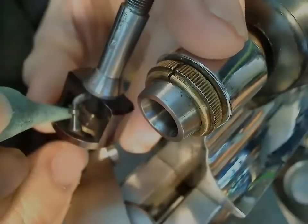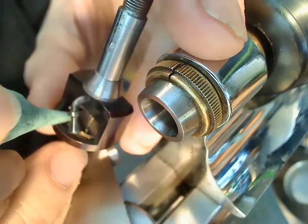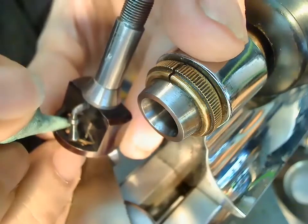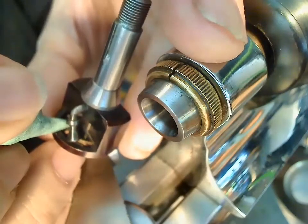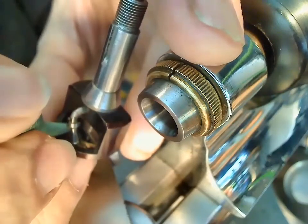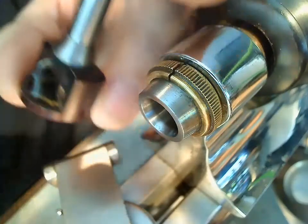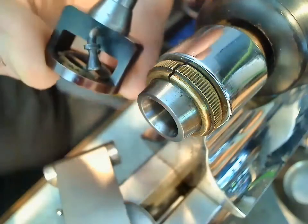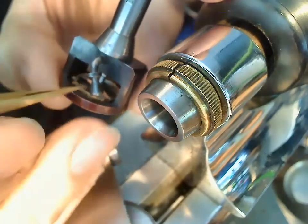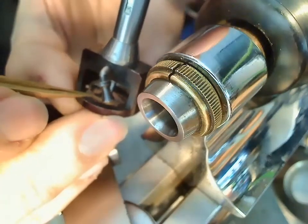I'm going to use a piece of Rodico because the Rodico actually sticks to the balance properly, so it doesn't rock back and forth, because what's happening is the balance is rocking all over the place. It's a rock and roll balance. And there. Okay, so there I've got the balance now stuck in there, and as you can see, it's pretty good. It's done in there now.